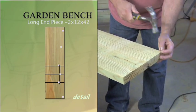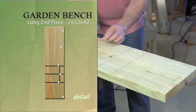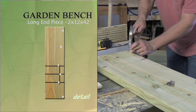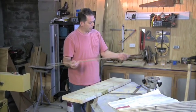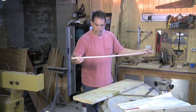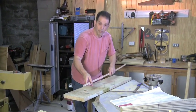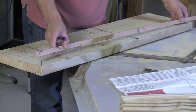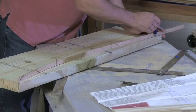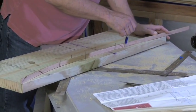Our next step is to set a series of finish nails in the board. These will mark the rough location of the curve along the back. This is just a scrap piece of wood about an eighth of an inch thick and about four feet long — a nice bender board which will give us just the right curve along the back edge of that end piece. It feeds right through the nails like this. Now all I have to do is draw a line along that edge and we've got our curve ready to cut.